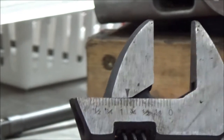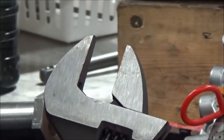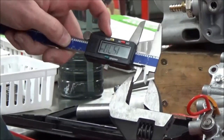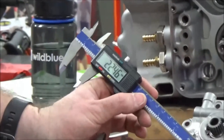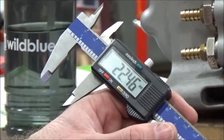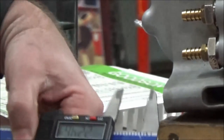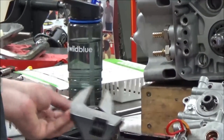Here's something else you can do. Let's just pretend your crescent wrench does not have a scale on it. You could take your digital caliper as a transfer tool — go ahead and find out. The fastener we're trying to work with needs a 22 millimeter. They don't make a 22 and a half socket. If it was 22.7 or 22.8, what size socket would you get? 23. But since it's 22 and a half here, and that's rough, you could probably fine-tune it a little bit. Once again, every mechanic should know.